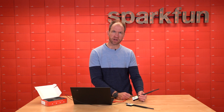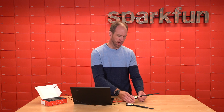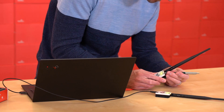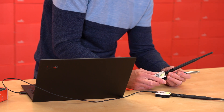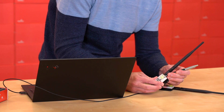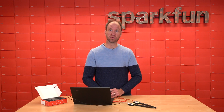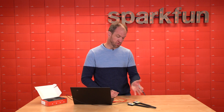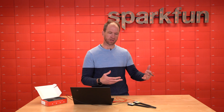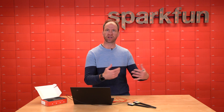Now I'd like to demonstrate the train button. Whenever we have a pair of radios, we need to be sure that those two radios operate on the same AES key and network ID. For privacy, we can use a ballpoint pen to hold the train button down for a few seconds on unit number one — the unit will start counting in binary and get up to about three, putting that device in client mode. The second device we put into server mode by holding it for six seconds. Once released, that unit is in server mode. The two units will connect, communicate, use a new automatically generated random 256-bit key, set a new random network ID, and link up. These two radios are now paired and operate on their own unique hop table, meaning no other pair of radios will be able to communicate with them unless they have the identical settings and identical AES keys — allowing privacy between radio pairs.